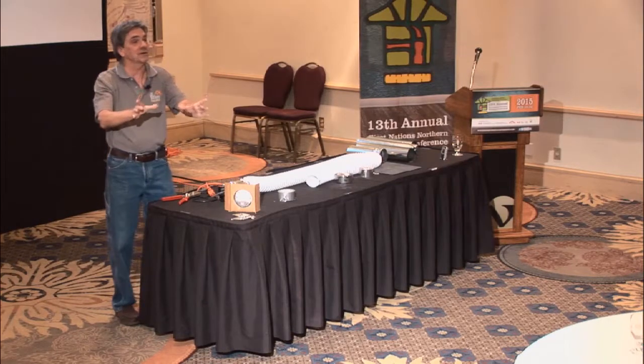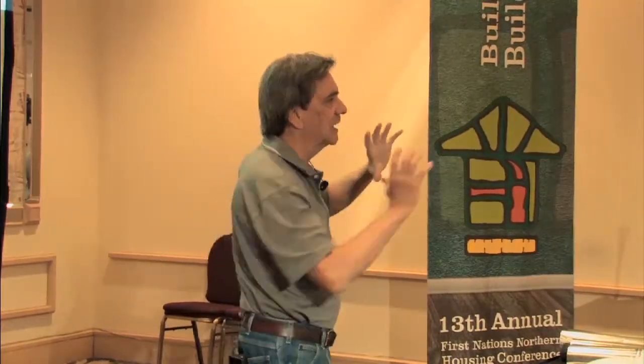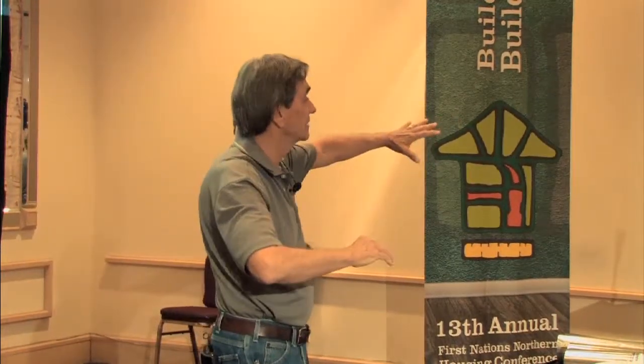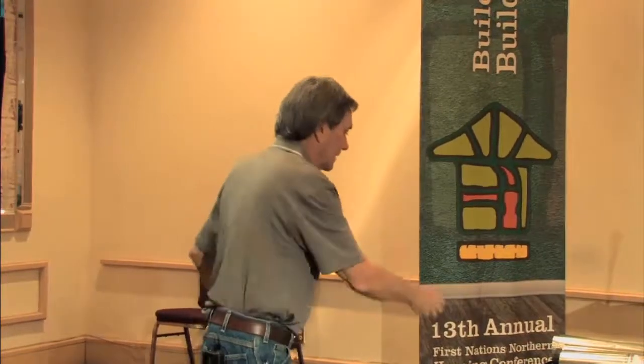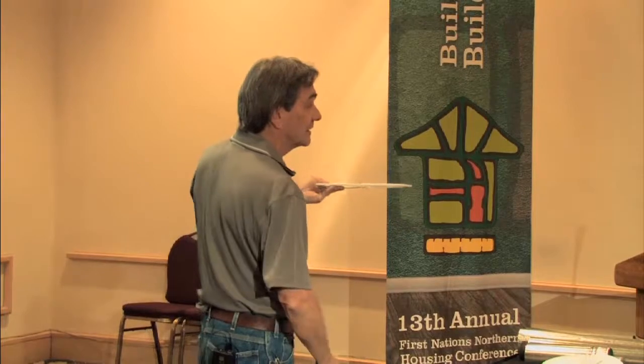Okay, your son wants a cold room. Okay, so he gets it really cold, and that's a problem with the rest of the house. And what's your heating system? Forced air gas? Yeah, forced air gas. And so he wants his room cold, but the furnace air is going up there. And so he's opening the window and wasting the energy. Why don't you just get him a damper on the floor that he can close? He can turn off the furnace.